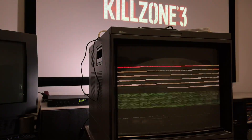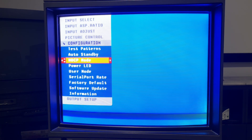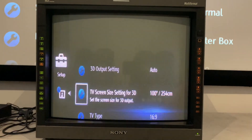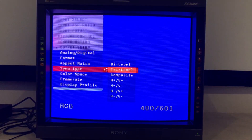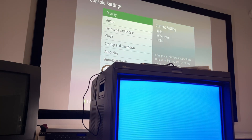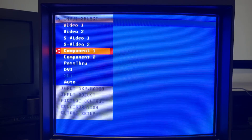So maybe it just had copy protection, but it does the same thing in gameplay, and HDCP on or off did nothing. I then tried connecting the PS4 and a standalone Blu-ray player in 480p, but got the same result. I went through all the different sync options, even combining HVSync on the output, but to no effect. I fired up the Xbox 360 and didn't even get as far as an out-of-sync picture, just the DVDO's generic blue screen. I even tried to hook up the 360 by component, and still nothing.